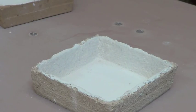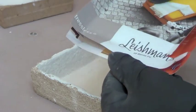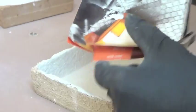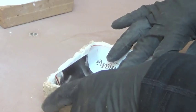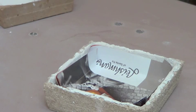Here's a little trick. Glossy papers like Sunday ads and magazines contain as much as 30% kaolin clay and calcium carbonate, which are both good mold releases. Cut and fold two layers of glossy paper and fit them into the mold on top of the release. During firing, the paper burns off, leaving the kaolin and calcium carbonate in a little space which helps greatly with the removal of the borosilicate piece.